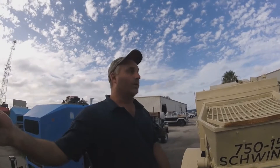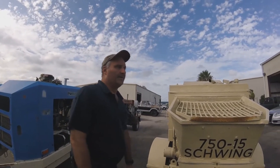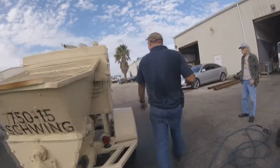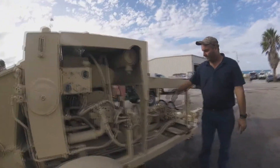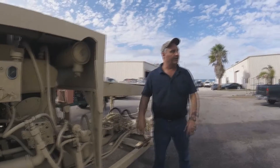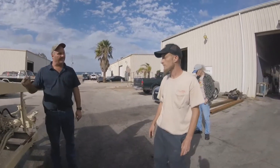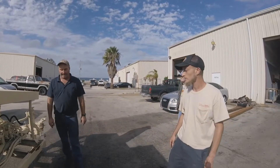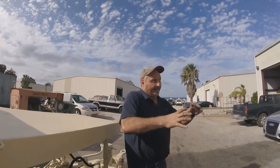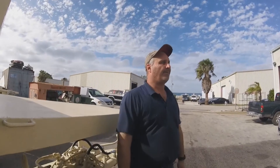As your helper is loading hose — about 200 feet — you grease. That's your final step. Then dump your water box, fill it in, wash it out, stroke it once or twice, check the bolts when it comes back, check again on the other side — if bolts look tight, you're good. Put the thumb pin back in, ready for tomorrow. Always leave it dry, and in the morning fill it up. The rod is hot in the center but the packings are rubber, so as the machine cools down it draws in water. If water is in there when you start, the first stroke returns it — always leave it dry.